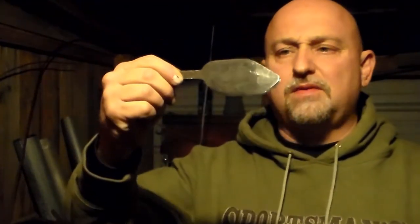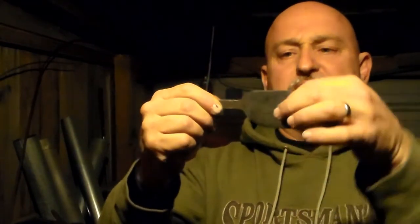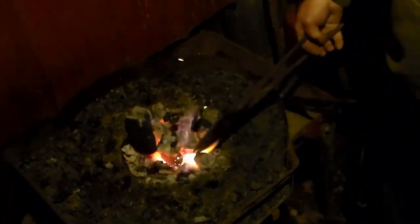Alright, it's forge time. What we're going to do here is just heat the blade. Notice how my finger goes across — that's pretty much all you have to get really hot. The coloring right there is just a slight temperature off; it really needs to be more of a yellowish tint. It still worked out fine — it was just the distance I had to go from one point to the next. Keep the blade as you put it in towards the tip and work it to the belly on the bottom. The top doesn't need to be hardened as much as the bottom.